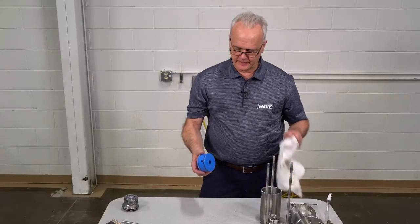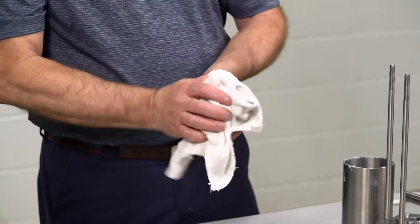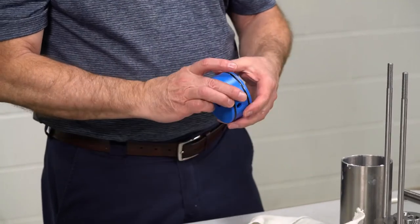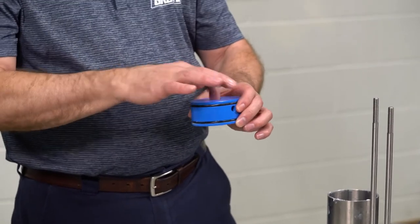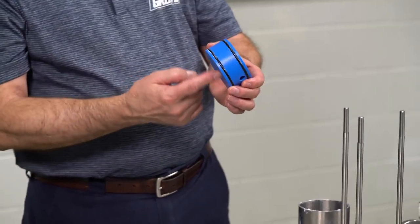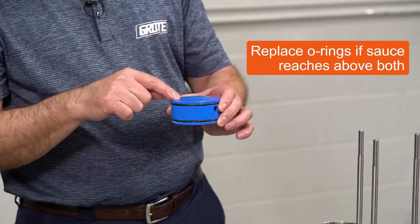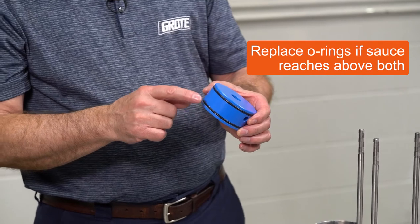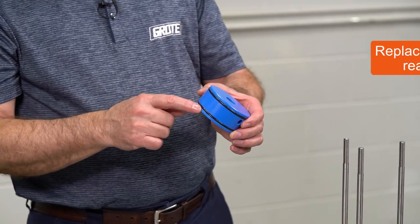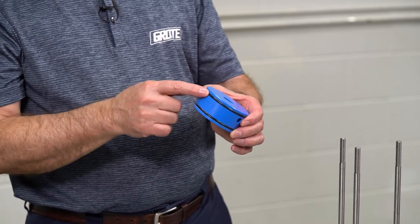The same thing applies when removing the O-rings from the piston — you're going to have to clean it off, it's going to be full of sauce. The pump will be in an upright position with the hole up. The bottom should be full of sauce, the middle should have a little sauce, and the top should have none. These O-rings are going to tell you when they need to be replaced based on how much sauce you get between them. You should never have sauce up at the top.